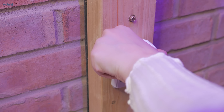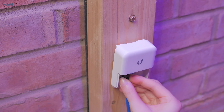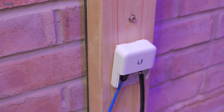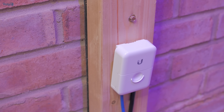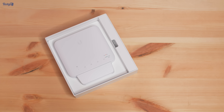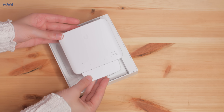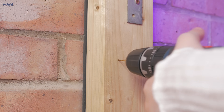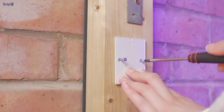I know I'm mounting it incorrectly and as a result it sticks out at a strange angle, but this garage is mouldy and covered in spiders, so if it's not going to appear on camera in future videos then I'm honestly not going to worry about it. From this I'm running a more manageable cable to a switch — the Ubiquiti USW Flex, which is an outdoor-rated gigabit switch that is not only powered by PoE but also provides PoE power to its four output ports.